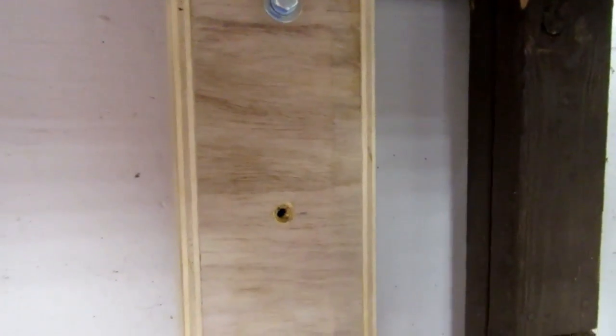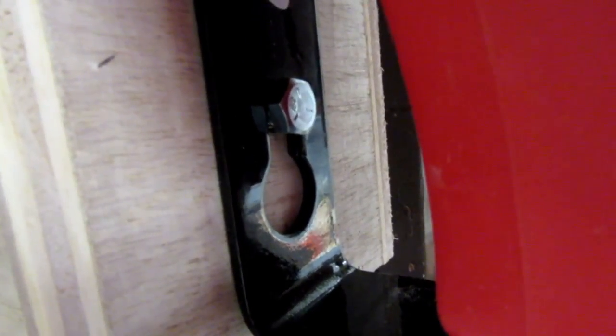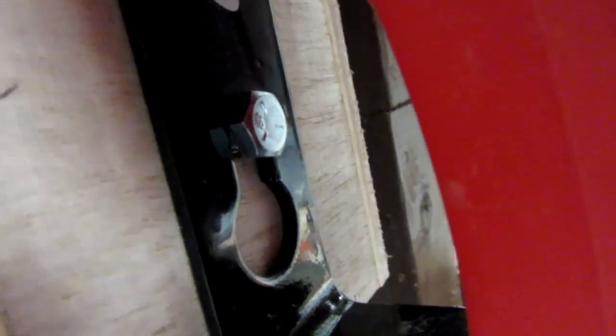As it turns out I could get the washers in there, but then taking it apart would be a real pain because you can't just loosen them, slide it up, and pop it out — the washers are too big. I looked at it and realized I have plenty of coverage from the bolt head by itself and don't really need lock washers. Just a couple of screws top and bottom do the trick. I'm not going to use that middle hole simply because there's no way to get a screw in there in actuality, and this bracket doesn't come off easily anyway without dismantling the whole plastic case.